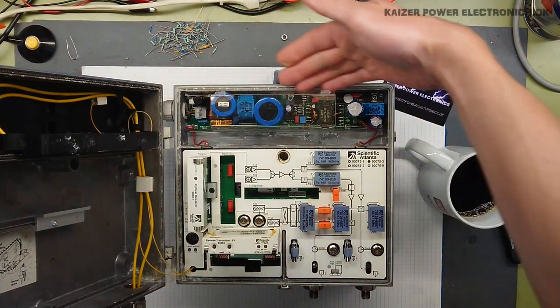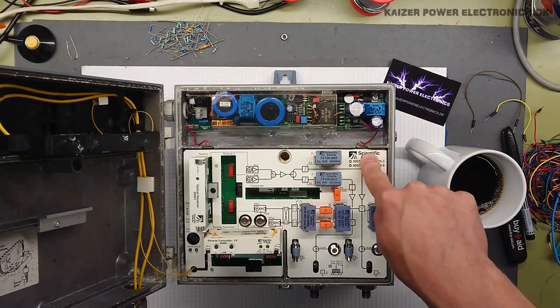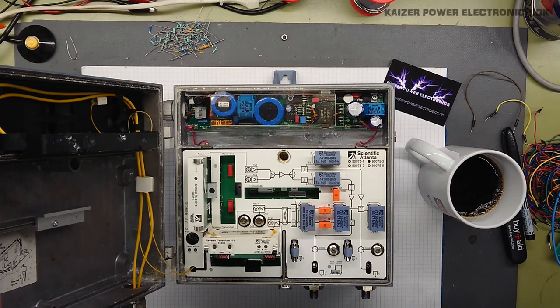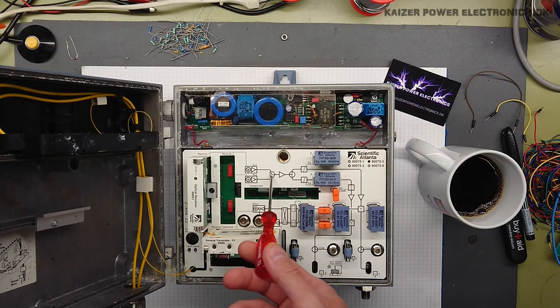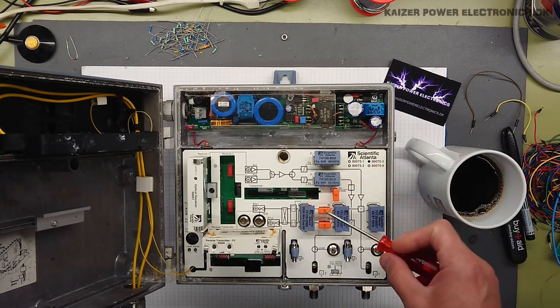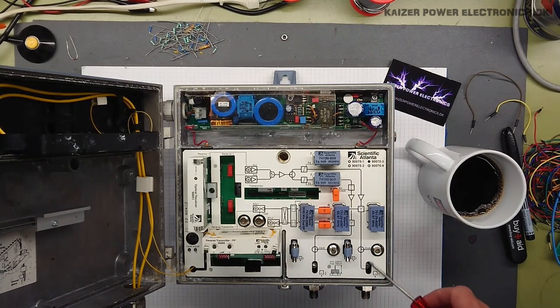These normally sport a very nice power supply with shielded inputs and outputs. From the schematic at the front, we can actually see how this entire unit works — we have two receivers which are switched between, go through equalizers with nothing attenuated, and just go out to two outputs.